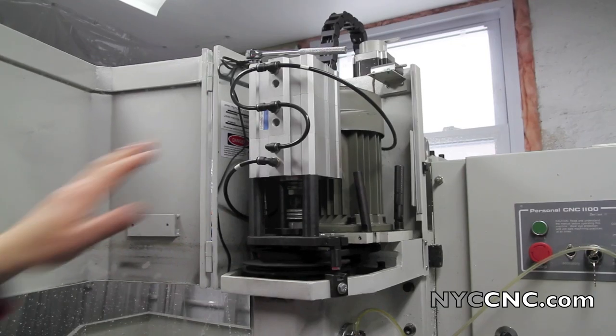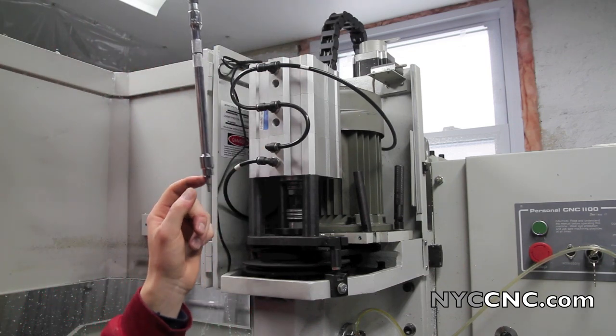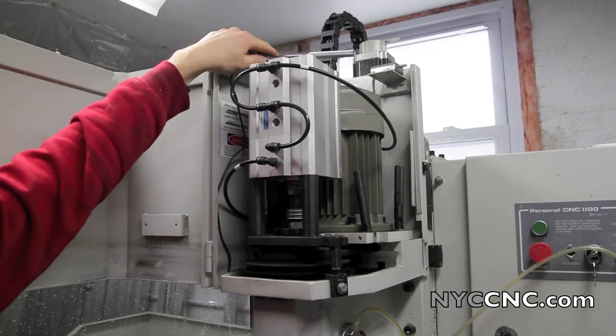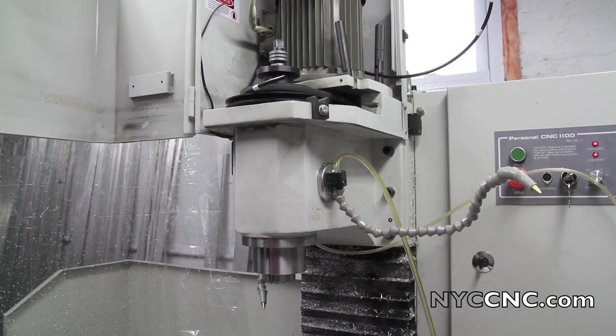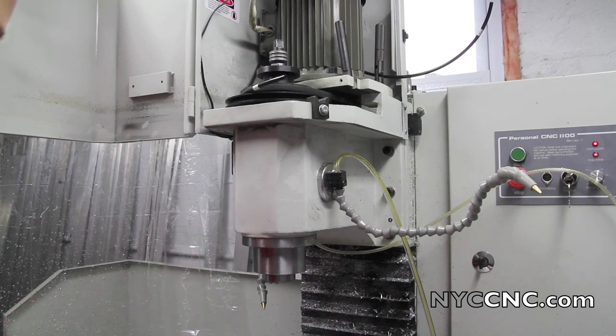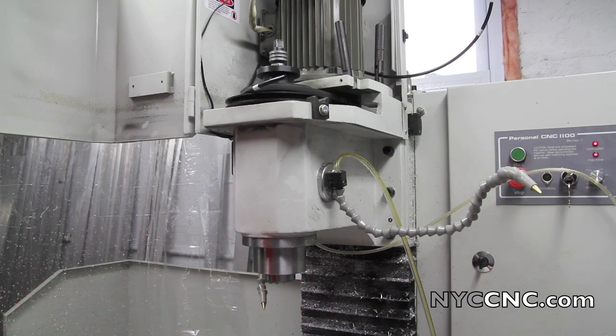I need to take the power drawbar head off. The easiest way to do that is to get a 3/16-inch hex driver, put on a long extension, and that gives you easy access to the socket head cap screw in the back corner. One of the dirtiest places was the inside of the spindle drawbar, which would have mated with the outside here — as you can see, there's some discoloration. I took my shop rag and some degreaser and was able to clean out the inside of that. Then next I'm going to apply the Never-Seize.